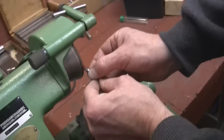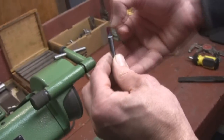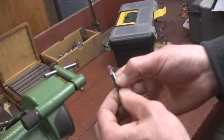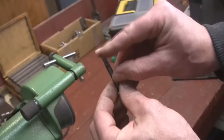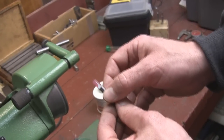A little bit more — just like that. Now we relieve this back and there you have it: a quarter-inch cutter with a perfectly ground sixteenth radius on it. We'll repeat this procedure for all the next cutters that we're going to sharpen here.